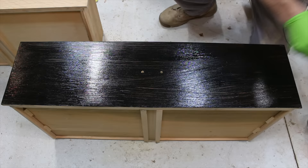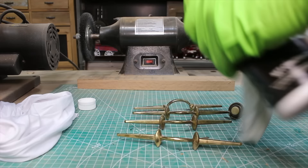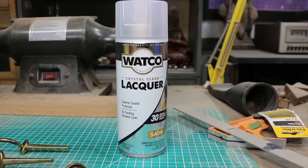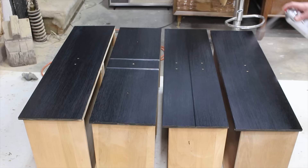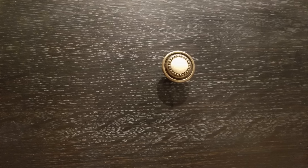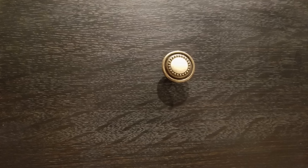After the first application, I still wasn't pleased with this stain color, so I applied two more coats. You could consider this project a practice piece, and for that reason I decided to use the original hardware and try to polish the plated metal by using a cream polish. Once the stain had completely dried, I sprayed on several coats of crystal clear lacquer in satin. To help blend the final finishes together and add an extra layer of protection, I'm applying a clear paste wax to the entire dresser. I'll wipe off all the excess with a t-shirt.